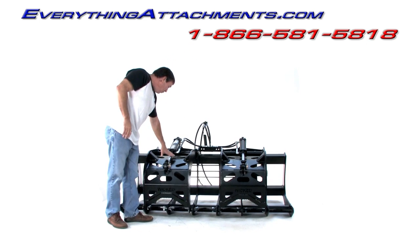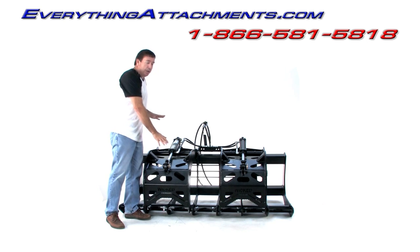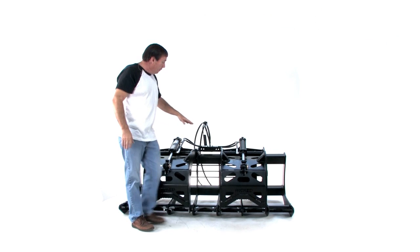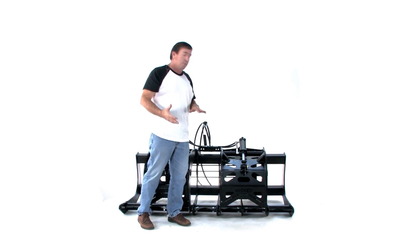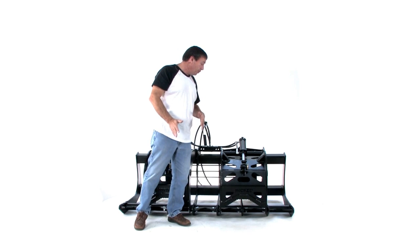With this 10-inch stroke and the geometry raised in the back, it's just going to give you a ton of gripping force and clamping force. And we've got these form gussets on the lid here where the metal's really high. We've added extra metal to keep them from twisting. These form gussets here just make these lids really, really strong.